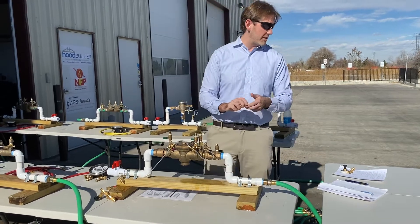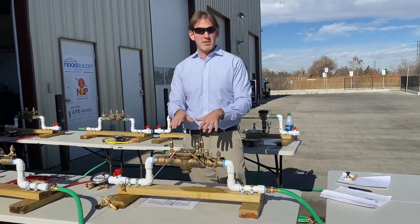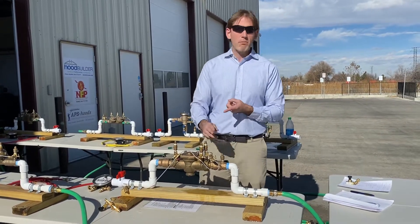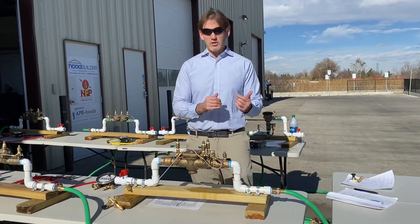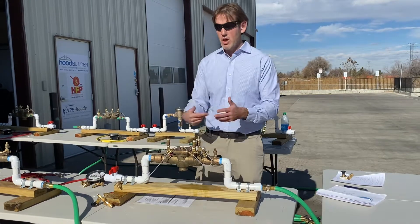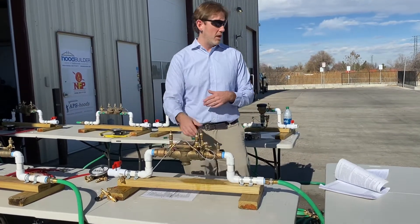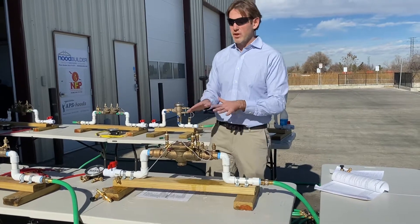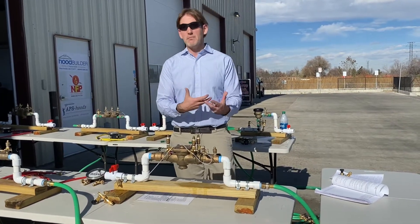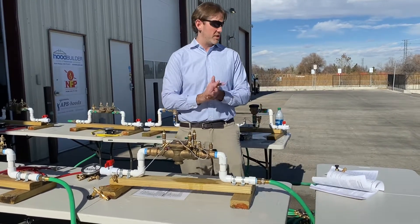The three things you're probably not going to encounter unless they have a different setup are multiple failures. You can't have multiple failures per ABPA — they won't have back pressure with a leaky number two shutoff check valve or something like that, like leaky number two with back pressure and leaky number two check valve. You're not going to encounter that, so it really doesn't make sense to prepare for it, even though in the USC book some of the steps will mention both of these failing. You could encounter it in real life but not on the test.